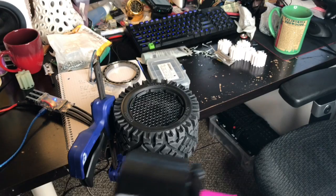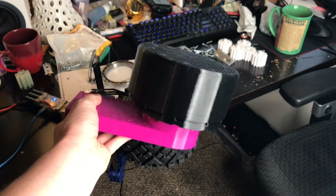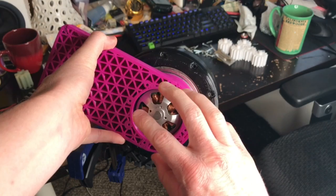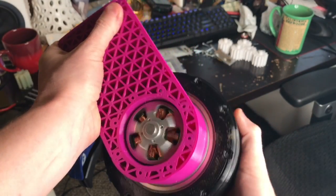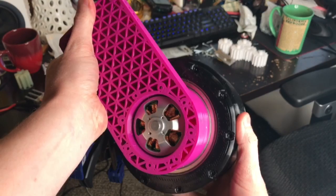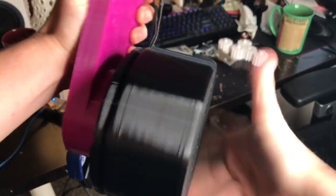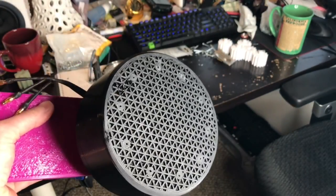This is planned to do that. This is the same assembly that's clamped to the bench, but with a couple of differences: there's no tire, and this isn't screwed together. That assembly has a magnet attached right here, and the encoder will mount on this screw pattern here. It says it's a planetary gearbox — a 4.3 to 1 gear reduction. You can see there's some restriction to its spinning, but with just a little momentum, it spins pretty well.